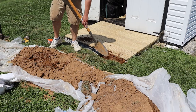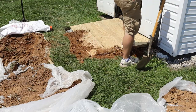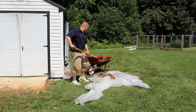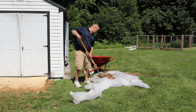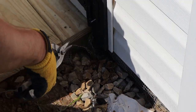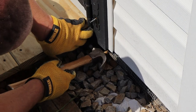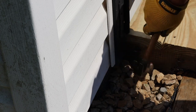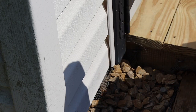Because I prefer the look of grass, I backfilled the ramp border with an inch or so of dirt over the gravel. After that, I removed any excess soil with my wheelbarrow. Next, I take the hardware cloth, clean it up a little bit, and then hammer it to the side of the ramp with some large galvanized staples to make sure no critters can get under the ramp or around it into the underneath of the shed.